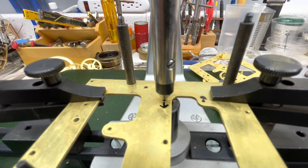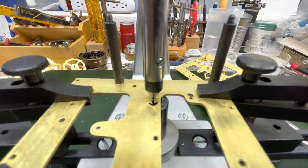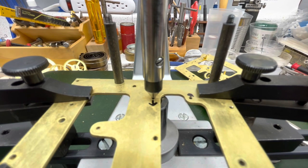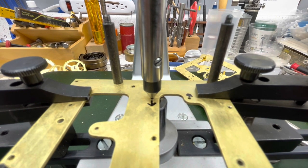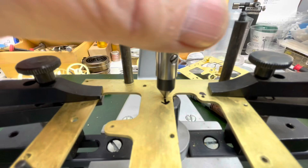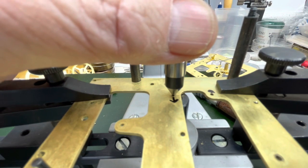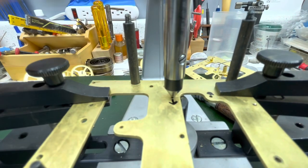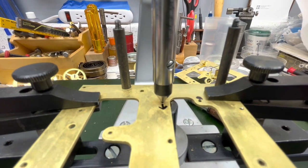This is what I look at. The oval is the pivot wearing, or the bushing wearing, in the direction of the arrow. And so what I'm trying to do is put the live center where the center originally was. And that way I can cut, and that's why in this case I would take my thumb and push against here when I'm cutting down, because that way it doesn't allow this to somehow move into the space. All right, so I'm going to try to do this bushing from about right here or similar.